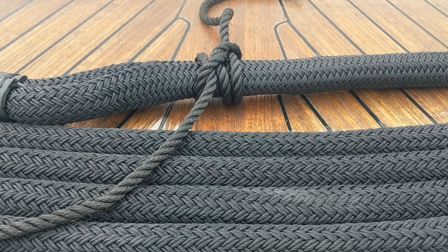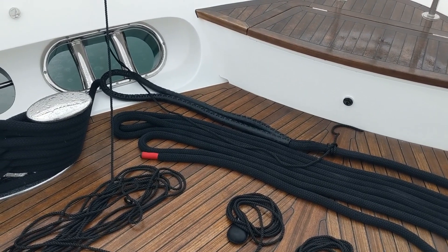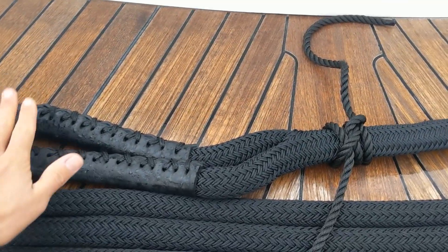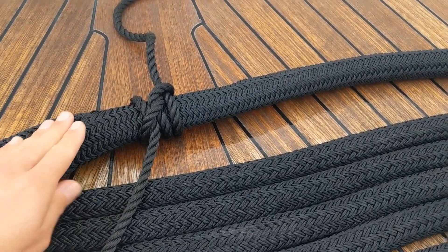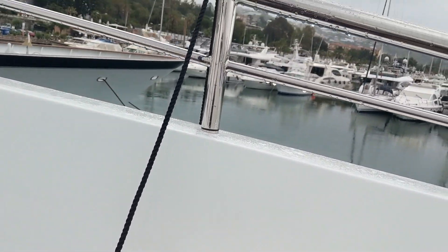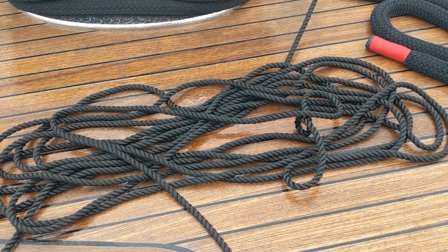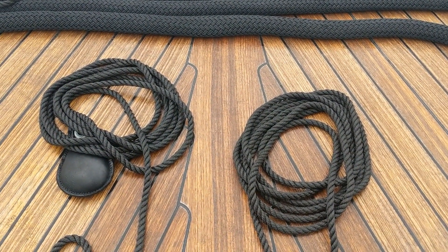And there it is — that's not going anywhere. That's our mooring line all set up and ready to go. As you can see there are a number of components and it can start to get quite messy, so you need to be really organized and know exactly where you've put everything. To recap: we've got our mooring line and eye ready to go out of that fairlead. The heaving line is attached at the base of the eye and it runs through the fairlead, then up over the bulwark and railing down to the deck. We know that there are no knots, and then we run to our two coils — coiled by you, ready to be thrown.